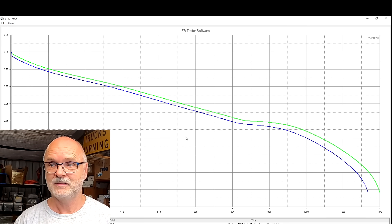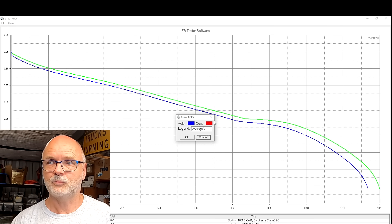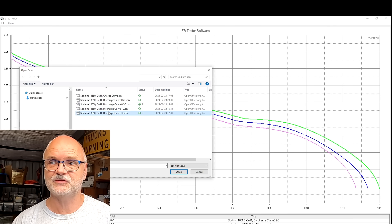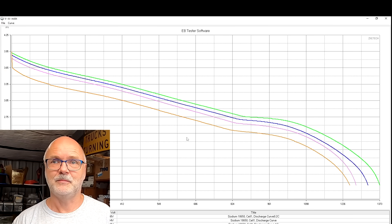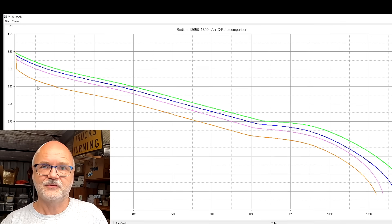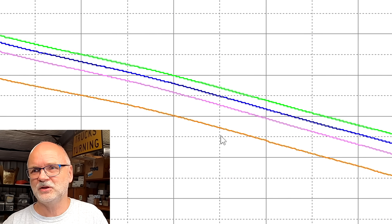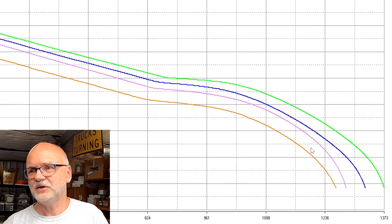Opening 1C in pink and 3C in orange — there you have it. The 3C discharge curve shows a steeper drop at the beginning, but from about mid-range all lines run fairly parallel through the plateau and fall off the same way — pretty even discharge regardless of C-rating. The green line sits at about 3.65V while the orange is at 3.35V, a difference of about 0.3 volts between 0.2C and 3C.